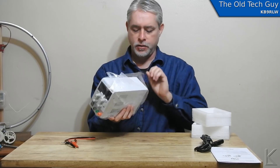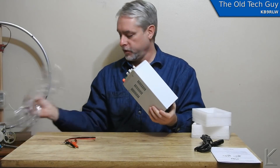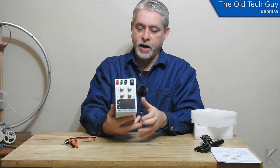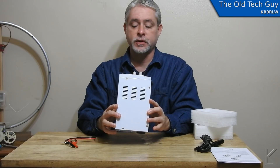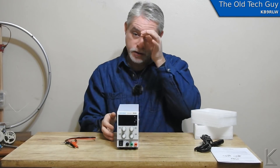The unit is really, really light — it's a switch mode power supply, probably a buck converter, which means it's going to be a little noisy for RF applications. For working on small receivers you probably would not want to use this, or maybe filter it, but for just average bench supply work on projects it looks pretty good.